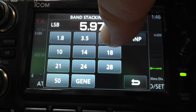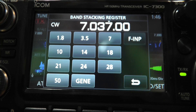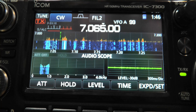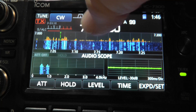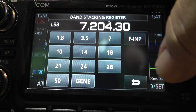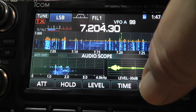In other words, each band has in essence a VFO right there. We'll press for one second and go there — got a VFO there. We've got these band stacking registers, and it's very useful to be able to put the mode in with the frequency. You can flip through them by touching the megahertz, holding for a second, and picking the one you want. When you get to the one you want, just push return. You can input a frequency directly, or use the band stacking registers. So there you go — a very simple introduction to band stacking registers. I thought it was a nice little feature for today's video. I hope to see you again tomorrow, and until we next meet, 73.